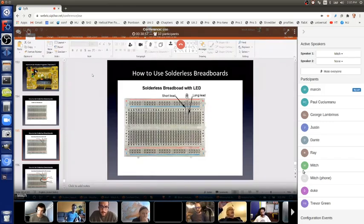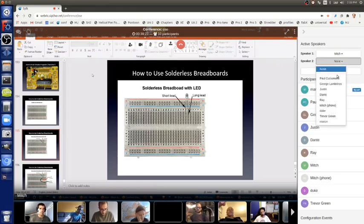In order to do that, I can connect one side of the wire to any of the ones above or below in that set of five, column 7: A, B, C, D, or E. 7B is already taken with the short lead of the LED. So I can plug this wire into 7A, 7C, D, or E.